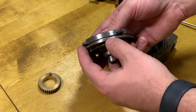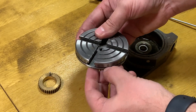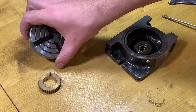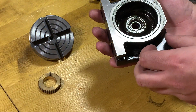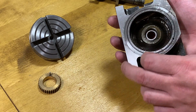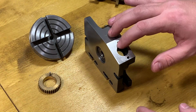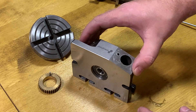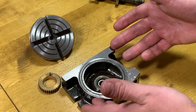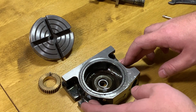The first step is done — I have a slot here. Next I will need to make a clamp that will press through this slot to the body of the round table. The best place for the clamp is this one and this one. It's possible to make clamps here or here, but usually when you're working with the rotary table it's mounted like this, and a clamp here or over here will be the best possible option. I will do one clamp, exactly in this place where the clamping screw was located.